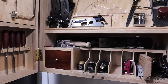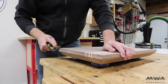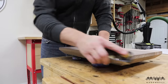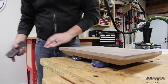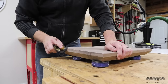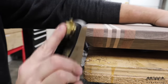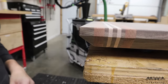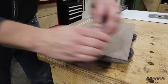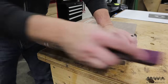For the next step I reach for my block plane. Taking down the sharp edge around the top of the board this way reduces chip-out that can happen with a router — there's nothing like getting to this point and having a router bit tear a huge chunk off the top edge. It's also faster and I love making curly shavings. I also get the little corners on the sides, which can be sharp. Sometimes there's a little fuzziness around the end grain, so I wrap sandpaper around a block of wood to sand it without rounding over my clean edges.